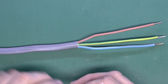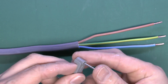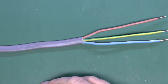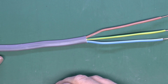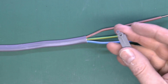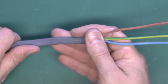In terms of attaching this to a wall, you can fix it directly on the surface using clips of this style that fit over the cable and are hammered into position. That's fine as long as the environment isn't somewhere likely to cause damage. In a house it wouldn't be too bad, though most people wouldn't want cables on the wall. In a garage where objects may fall against it, it's probably not appropriate, as the outer covering is fairly soft and can be damaged.